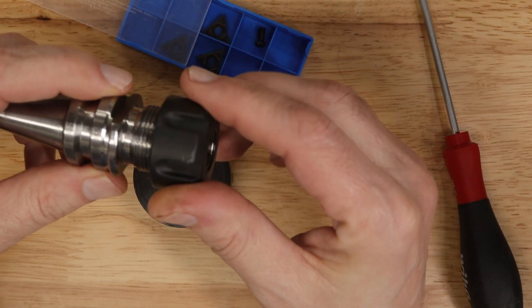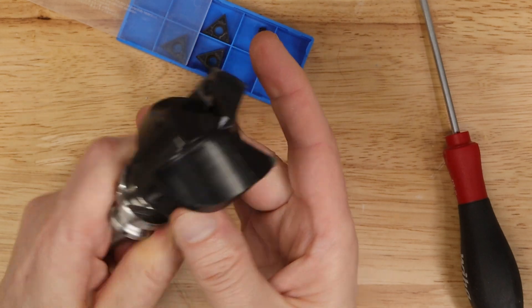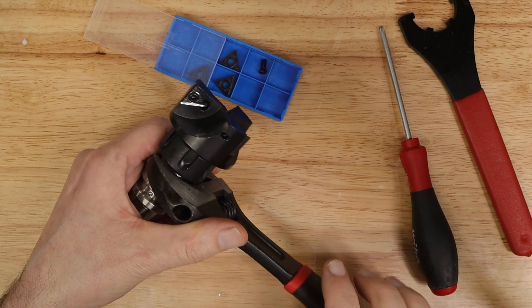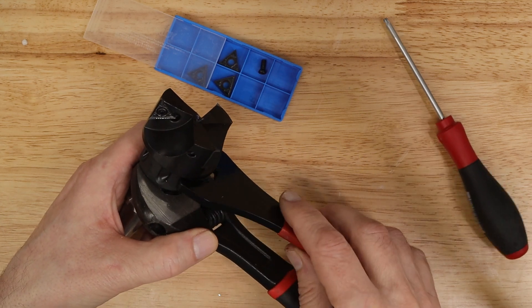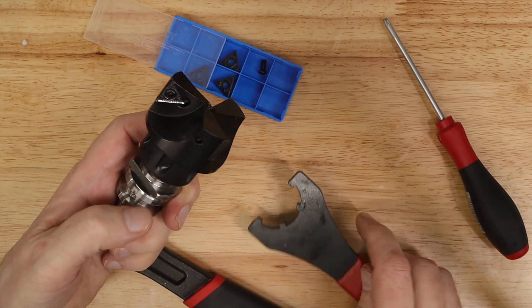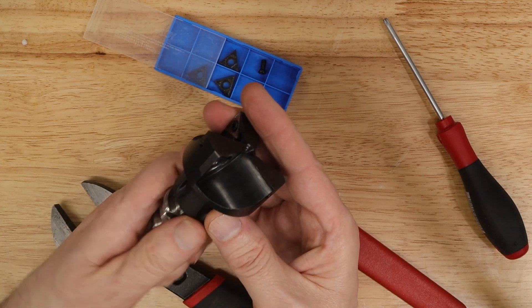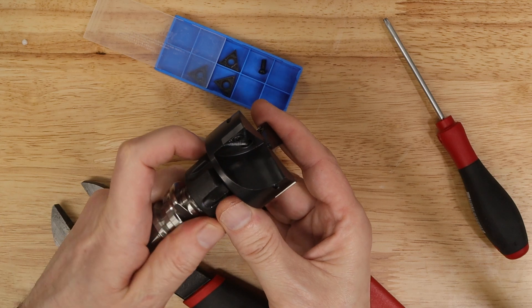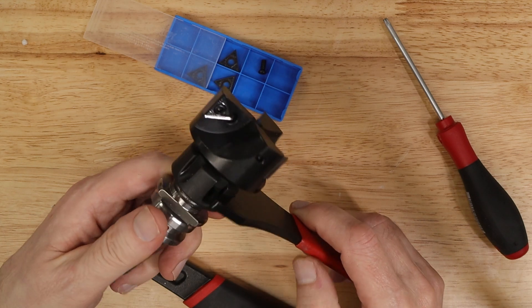Let's go ahead and put this back into the tool holder. This is how I tighten it — I don't have a tightening fixture for the ER20 holder because I only have one ER20 holder. I just noticed that I need to have this out a little bit, because if it isn't out a little bit I can't get the wrench on there. So maybe for this one, 1.5 inches or so is actually better.